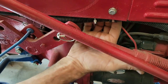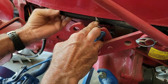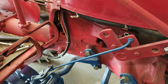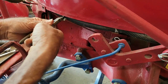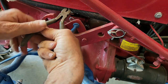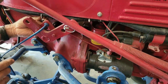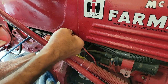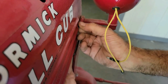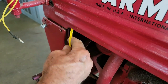Up under the hood here, I have clamps and things to hold the wiring in place, so we've got to get up under here and undo all of this. I've got it zip tied, so I'm going to take my little snippers and snip these zip ties off. One thing I've learned — keep that wiring tight. We also want to make sure we feed our wires back through the little rubber grommets, because I put all new grommets on this whenever we rewired it.